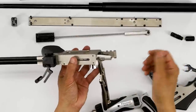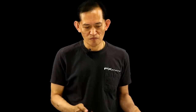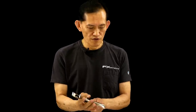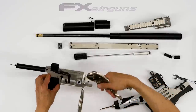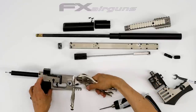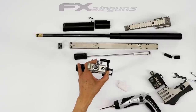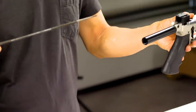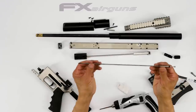This valve rest is already loose — this is a common issue; it gets loose and that's when you lose power. If it wasn't loose, there's another modified tool — another vice grip also shaped like a half moon so it doesn't damage the piece. You adjust it; usually I'll have the action in a vice so it doesn't move. Apply just enough pressure to turn the rest and screw it off. Be careful with the spring — it wants to spring out. Anyway, that's the whole valve assembly. On the older style the spring comes in three pieces; the newer style has just one single spring.